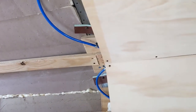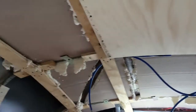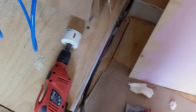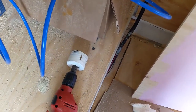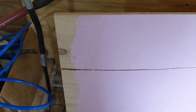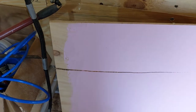It's the next afternoon after my son and I worked on the ceiling. I'm going to cut panels to go in this front section and also drill the holes for LED lights in the rough area of the X's I marked before, measuring them more carefully based on the hat channel locations. I've got one of these LED lights and I'm going to test fit with this hole saw — it's slightly larger than I'd like, but I'd rather not have to go buy a new one. The hole's drilled and I'm going to test fit it for slop.